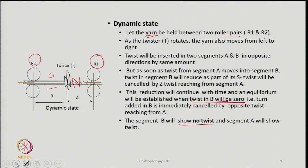Now, we will just go to the working principle, just briefly we will let you know how an air jet spinning machine is going to work in very simple terms. You can see the image on the right hand side, that here we have this lever, then we have the drafting rollers from here to there. Here we have the jet, and then we have take up rollers followed by the package formation unit. Here is the package formation.